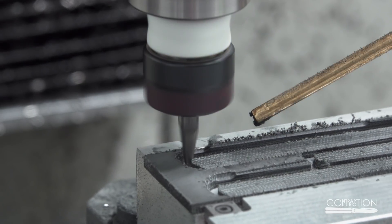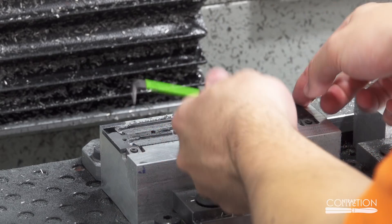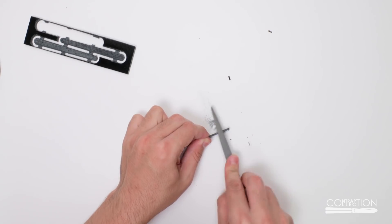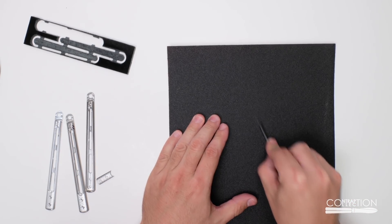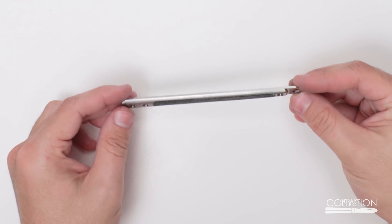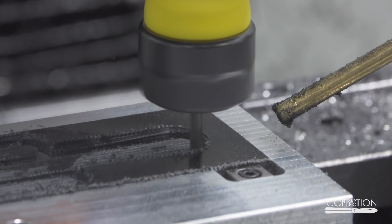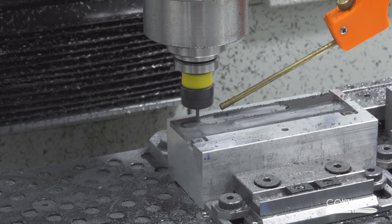There's one final step: using a tapered end mill to create the surface that is held in by the dovetails. The tabs weren't too hard to cut with scissors, then I can easily file down the extra material. I had the same problem as before — the scales are too large for the slots. At least with these it's pretty quick to sand them smaller. I think it's starting to look pretty cool. I made a measurement of how wide it was when it fit so I could try to adjust the machine to match, but I still don't like how much the material is flexing, so I decided to switch to doing two blanks instead of three. This seemed more stable.